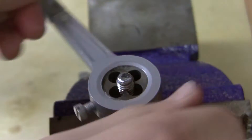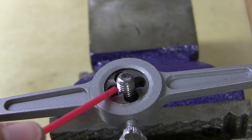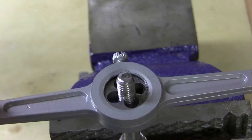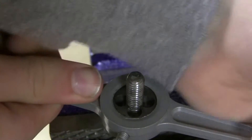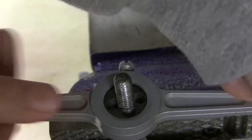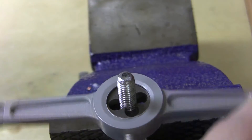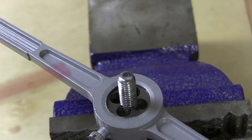Right now I'm not really cutting anything, but I still take a few turns then cut the threads by going back. The threads are getting shinier. Let's apply a little more oil. I think we got through them — let's just go all the way down just for the heck of it. Now I'm starting to cut threads on the part that isn't threaded yet, so I'm just going to tighten the vise a little bit. I'll take about a quarter to half turn, then turn counterclockwise to break the chips — you can listen to that. This is steel, so these are pretty tough.